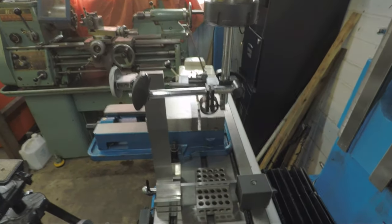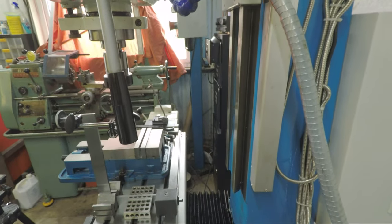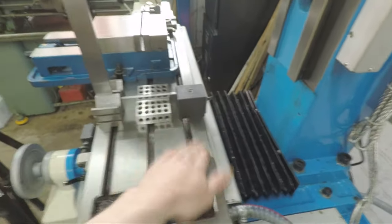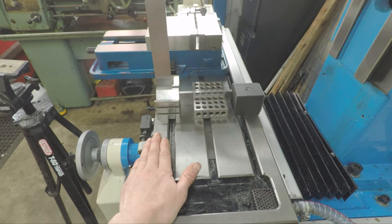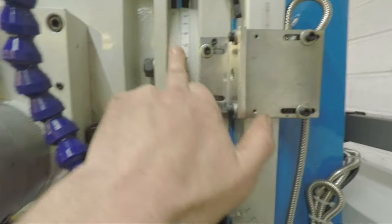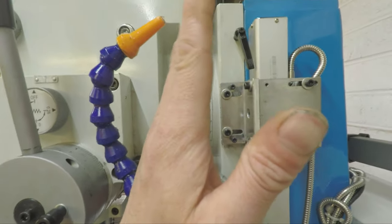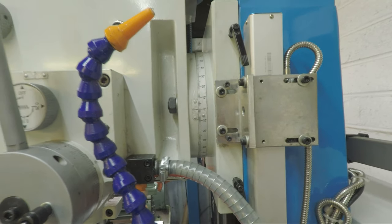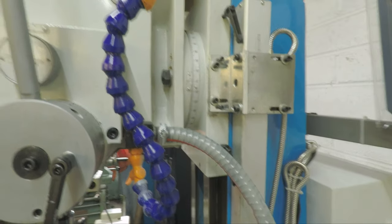It's actually saying that the column is listing back, which is the opposite to the initial measurements. We tested the table from the spindle and this side the table is 0.3mm up. So that's telling me the problem is in here - that may need scraping and bending back like this, or this bit. Not sure yet, whichever is easiest.